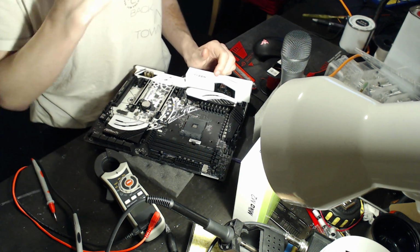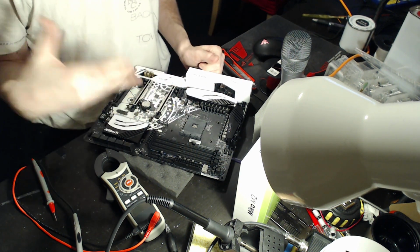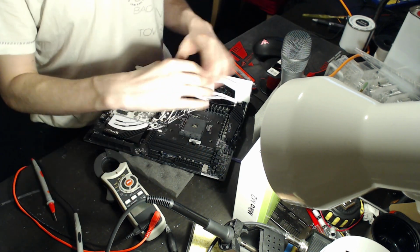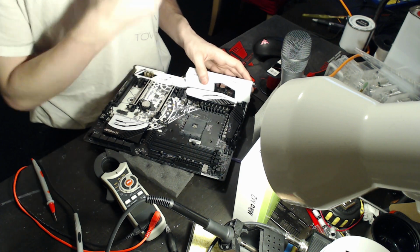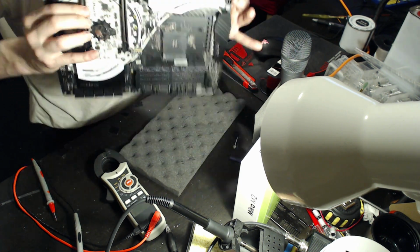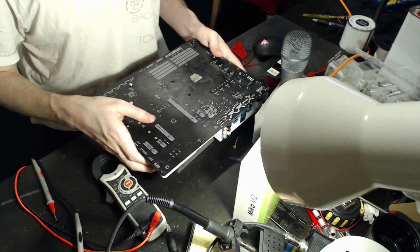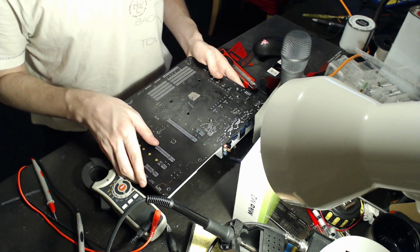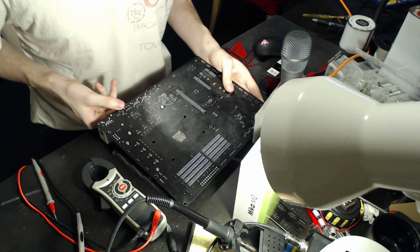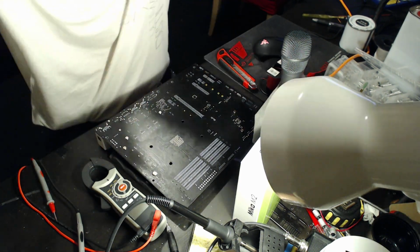So today we're just going to add a voltage sense line so you can actually get accurate physical readings and not, you know, garbage that you get if you measure right off of the Vcore VRM. So let's flip this over and look into the, and actually I'll move the camera because we will be doing close-ups here. Hopefully, and I'll actually have to manually focus this because autofocus on the webcam, of course, sucks.